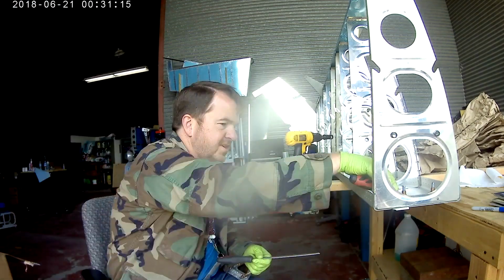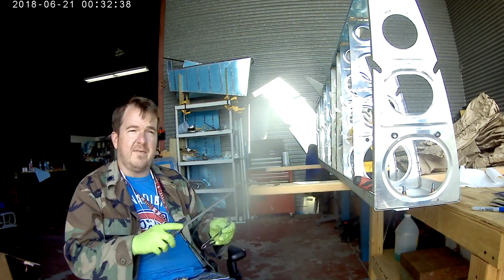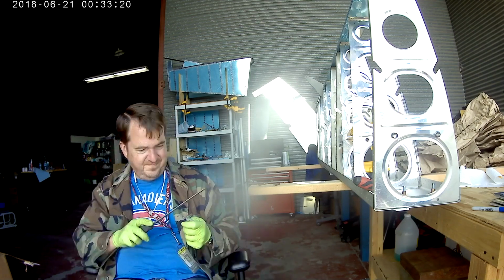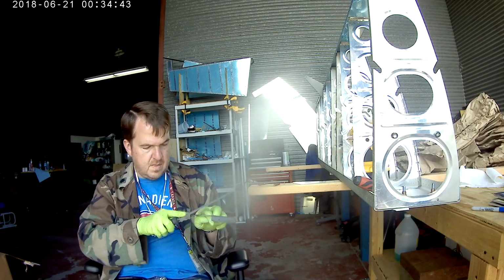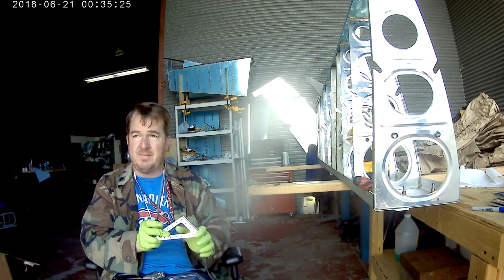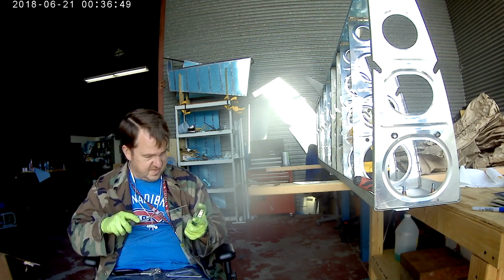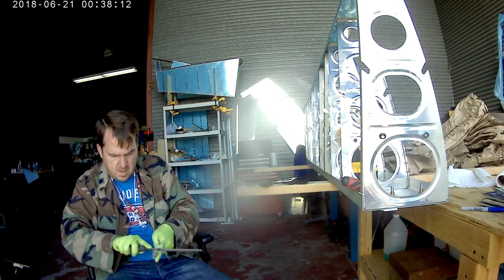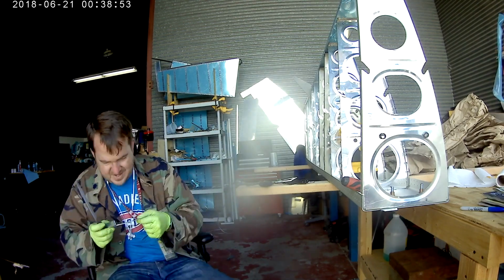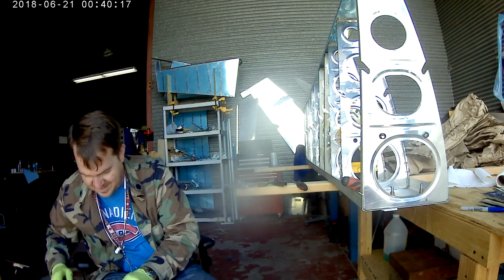So now we're working on the rear spar. The ribs have all been done. The appropriate ones have been riveted into place. And so now we're working on all the pieces of the rear spar. The rear spar has several pieces. There's the main rear spar itself. On the inboard edge, there's two big doublers. Those are attach points for the fuselage. And there's a few small doublers along the way, all the way out towards the tip of the rear spar.